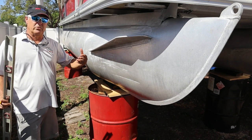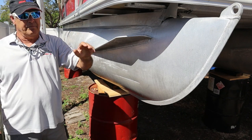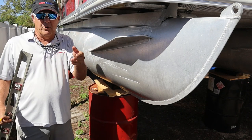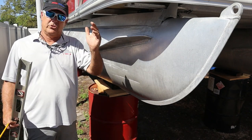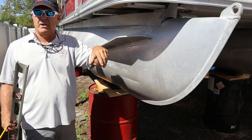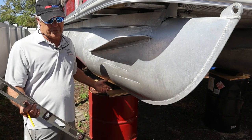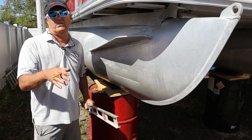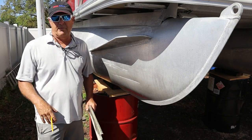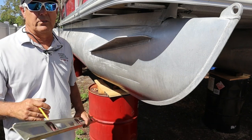With long outboard uprights, your boat comes in along the edge of the shear line, then you pivot back and forth to line up like an airplane on a runway. You inch your way up, the bottom sits onto the longitudinal two-by-fours, keep the throttle on, aim for the center of the trailer — it all lines up much better for current and wind, and you don't damage your boat.